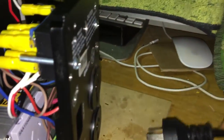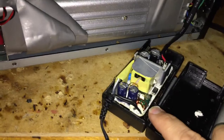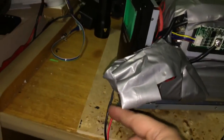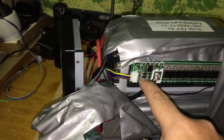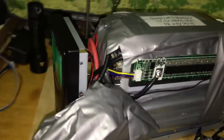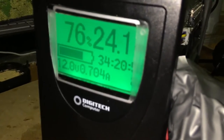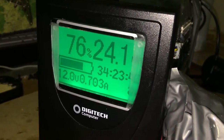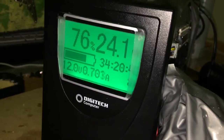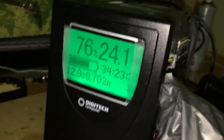We'll just unplug that for the time being. So now we've got the 12-volt DC charger — it goes in here. Positive goes straight to the battery, but the negative has to run through the BMS, and it regulates the balancing and all that kind of stuff. At the moment we're losing about 700 milliamps per hour — that's just the standby current of the inverter.